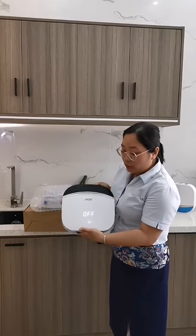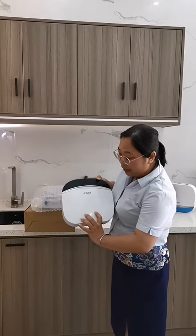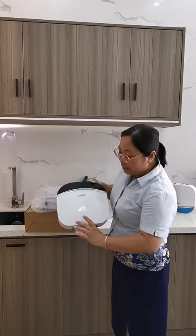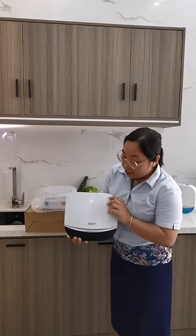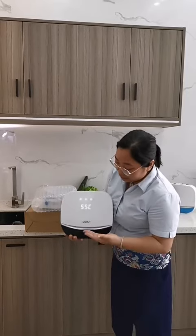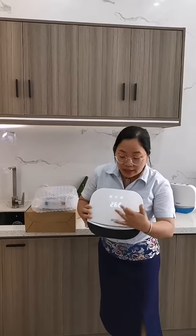You need to turn off the water heater, then press the decrease and increase key for 5 seconds. Then you can see the digital display is upside down. Then turn off and turn on — it will show the digital temperature upside down too.